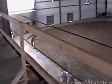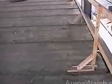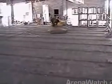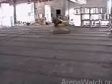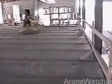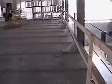The initial occupancy rating, the way this was set up, was the rink was a public assembly occupancy. The first floor in the center core was a public assembly occupancy. The second floor, based on BOCA, was rated as a business occupancy. And then, of course, we had the manufacturing side. The problem with the upstairs being a business occupancy is the codes required a 2-hour wall on the separation between the offices and the ice rink.